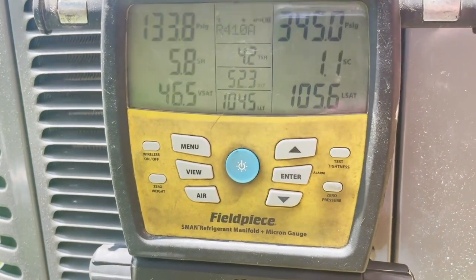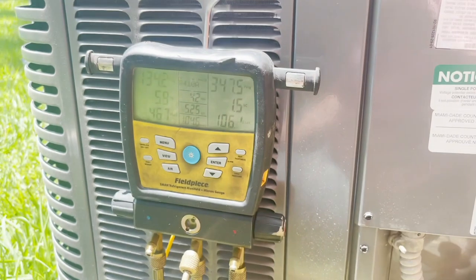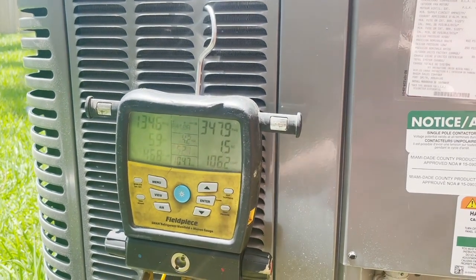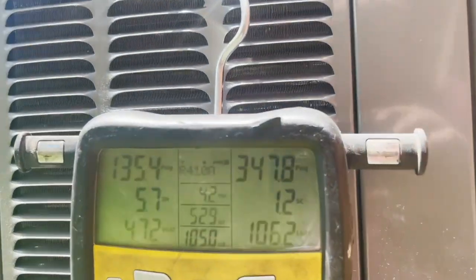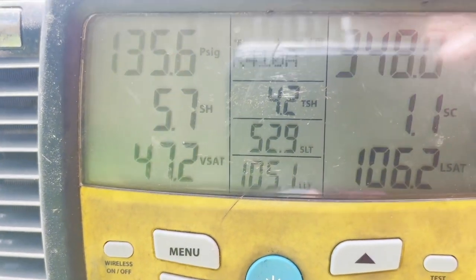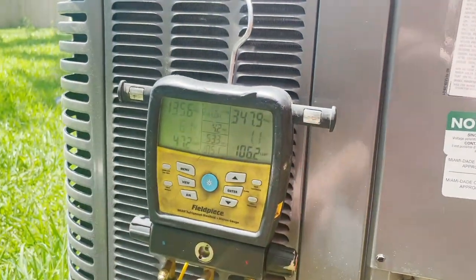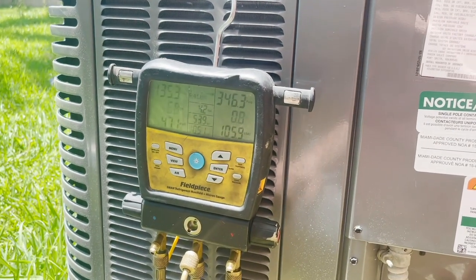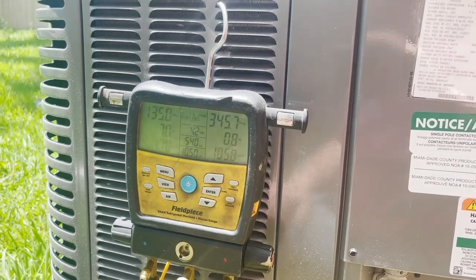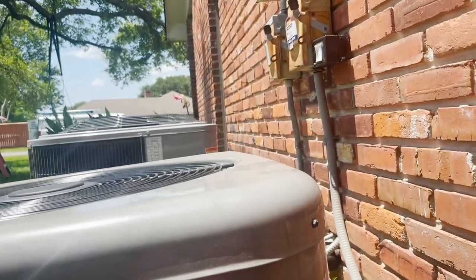Okay, guys, we're gonna leave it right there because, again, when it's above 80 degrees in a space, an expansion valve is wide open. It's kind of working like a piston. Our superheat is beautiful. Pressures are beautiful, but I don't want to add any gas to bring the subcooling up because then the superheat's going to drop so low it's going to start flooding back. So we got to perform a maintenance on that Temp Star right there.